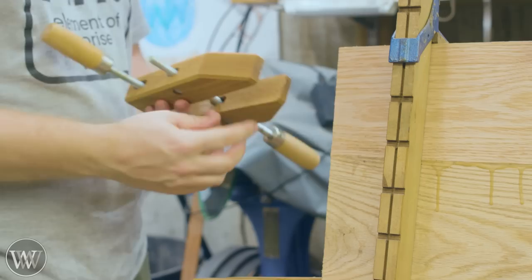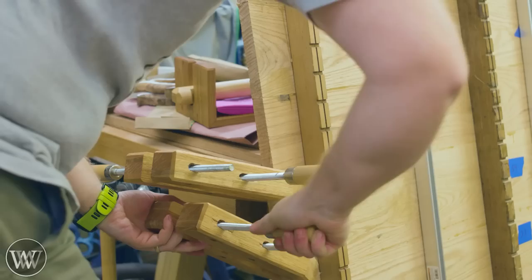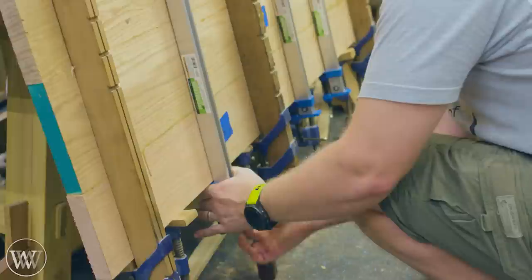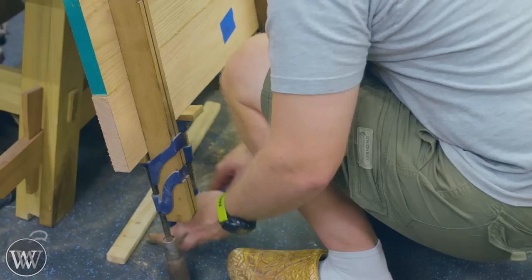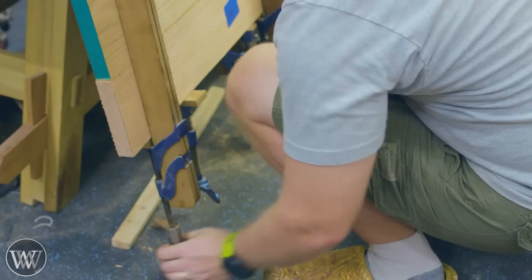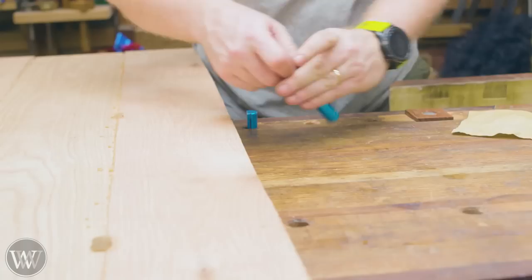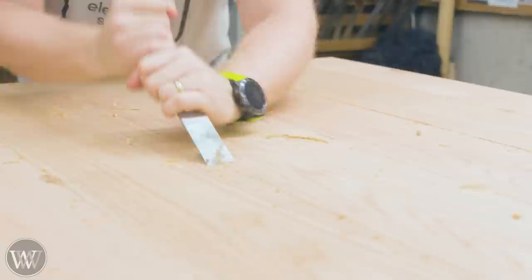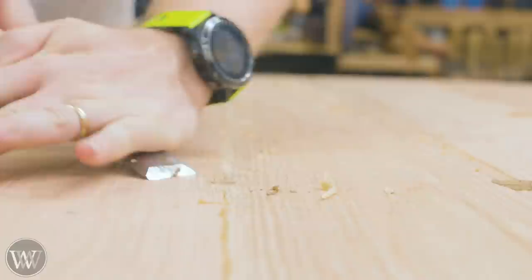Once that's all out of the glue, take the clamps off. I coat them all in paste wax about once a year - that stops the glue from squeezing up on the clamps and they come right off. Now we have all that squeeze-out to deal with. The glue actually comes off pretty quickly and easily. I'll grab an old Harbor Freight chisel, clamp the panel up in the bench so it doesn't move, go at it with the chisel bevel down to do the heavy work, then come in with a nicer chisel riding on the heel of the bevel, which allows me to basically plane right down to the surface very quickly.